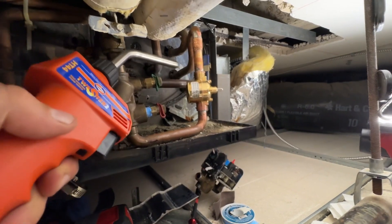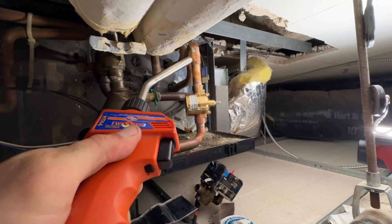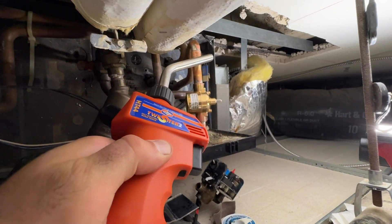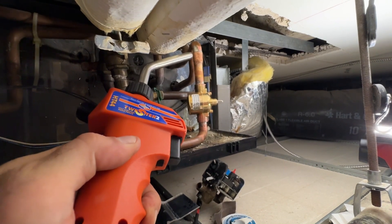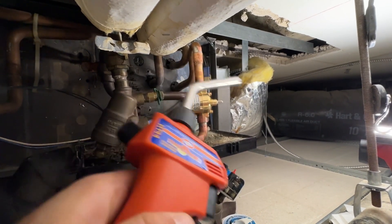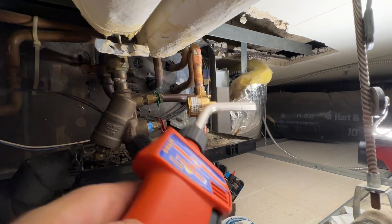What I was doing there is heating on the opposite side of the fitting from where I'm touching the solder, but not trying to overheat that side. You've got to be real careful because once you overheat flux, it becomes a contaminant and it stops that reduction reaction.